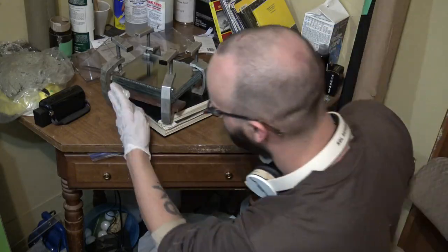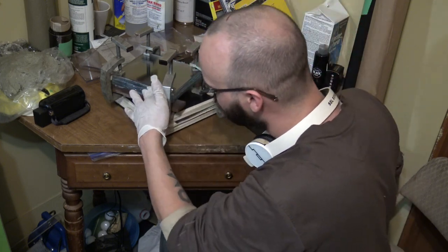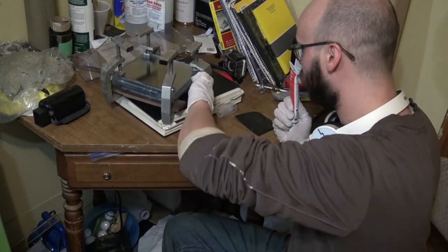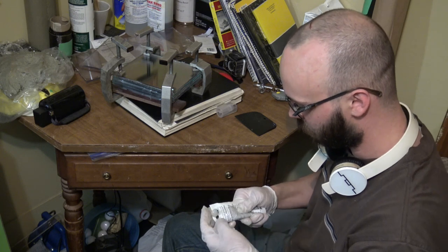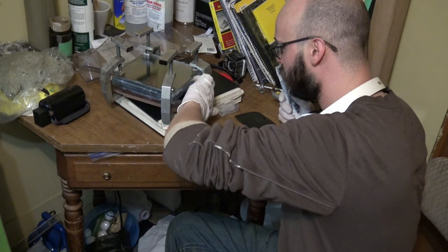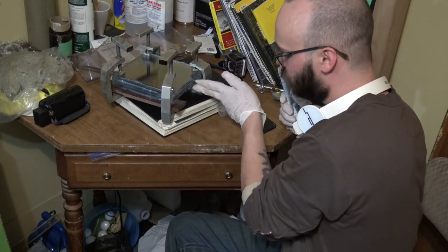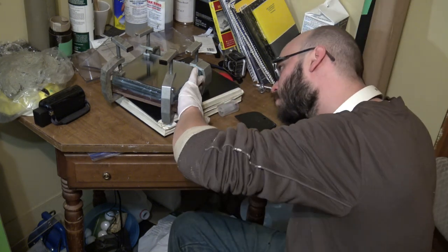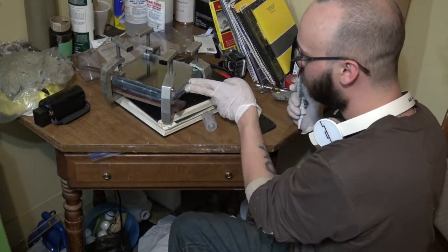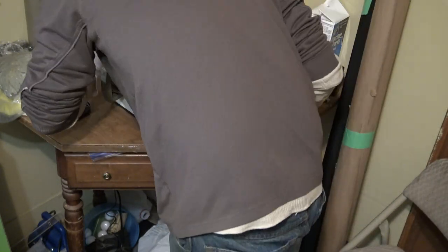Down at my workstation I had already placed clamps with little blocks of wood to avoid scratching. The back end of the silicone container blew out so I was applying it by hand rather than with a scraper, which made it messier than I wanted. I was racing against the clock because the plastic was still quite warm and the silicone was setting up very quickly. You also want to do this in a well-ventilated area and wear gloves — the silicone itself isn't toxic but the solvent mixed into it is.